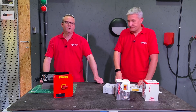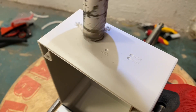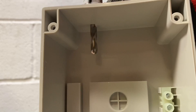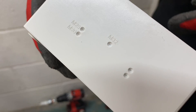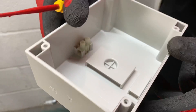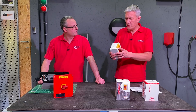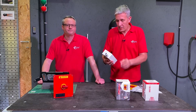Thinking about the cable entry holes — we drilled some into our enclosure and they nicely set out where they'd like you to position them and what size hole you can use. There are also hole positions in the back and the side, but there's no fixed top or bottom — it's completely reversible. You can use the pre-marked drill positions for common cable gland sizes, or there are more regular-looking knockout positions on the bottom for looping in and looping out. You can put the lid on either way too, which I'm not sure you can do on all isolators.